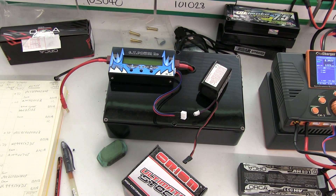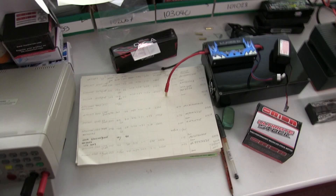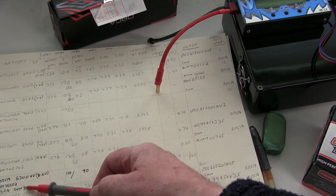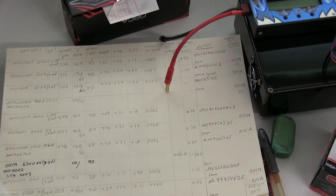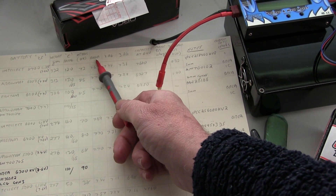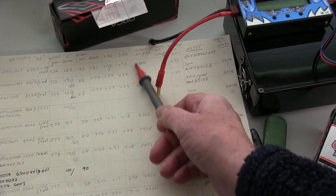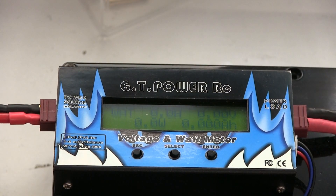So we're going to put that onto the discharger, measuring the voltages under discharge load — exactly the same as with all the other batteries. We've recorded all the results previously from Intellect, Aramax, Phantoms, and now Orca. I'm going to write down the results for the discharge at high current: 40 amps, at 600 milliamp hours, 2 amp hours, 3 amp hours — and measure the complete capacity as well.